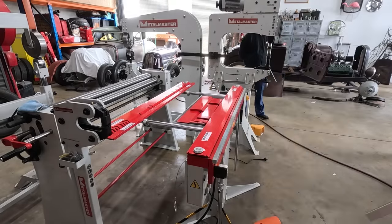Okay, so this kind of worked out really good. Just kind of smashed it into the same die, got that piece on, and then I cut the outer piece. A little bit of stretching on the edge, obviously, well, a lot of stretching on the edge to get that curve. Did have to kind of manipulate it, stick it into the shrinker to get some shrink here because there is a slight angle in on these planes.